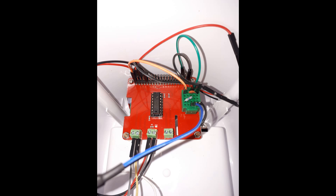I used the Pi motor controller hat to control the motor from the Pi. The hat is just a motor control chip that connects to some of the Pi's pins — any other motor controller should work. Only one channel is needed since a single motor only ever goes forward. The ability to supply a separate 5V voltage is necessary since the motor runs off 5V, not the 3.3V of the Pi's GPIO. In our case, the feeder already has 5V so we just use that. Only power a motor from the Pi's 5V pins — these are the raw power source, and using different pins will probably cook your Pi.